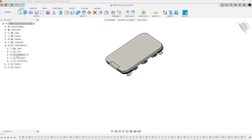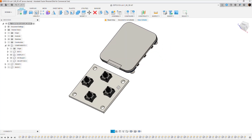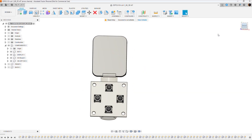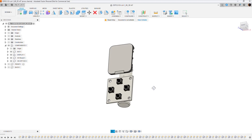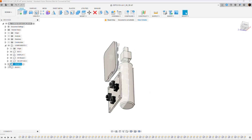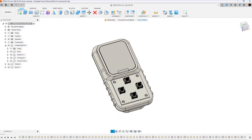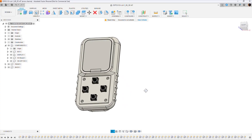For the design of this project, we first imported the 3D model of our ESP32 display into Fusion 360 along with the CAD file for our button PCB with buttons, as well as the lithium battery and the push switch CAD file. Next, we organized the components in a logical and practical layout: positioning the switch PCB beneath the display, placing the battery behind both the display and the switch PCB, and positioning the push switch on the rear side just above the battery. For aesthetics, I opted for a boxy retro design reminiscent of the 1990s, drawing inspiration from classic Nokia phones.